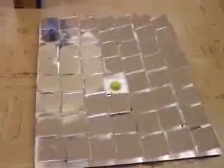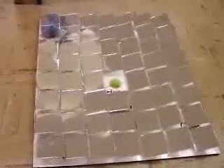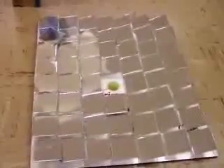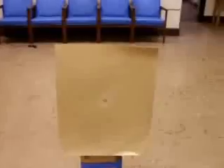What we're seeing here is my platform with an array of seven by five inch mirrors — five inch by five inch mirrors. It's on the floor where there's a bunch of floor tiles that are going to help me figure out the right angles to model the sunlight. Right there is a target that I've set up. That little white thing with the black spot is modeling where I want all the sunlight to go whenever you're cooking with this thing — to that one spot, which is going to be the bottom of your pan. It's in a fixed relationship to this platform on the floor.